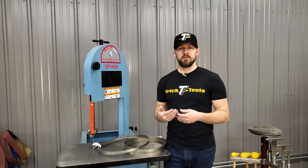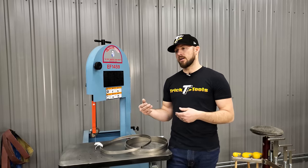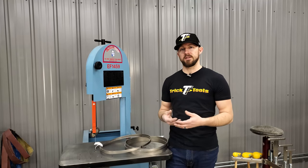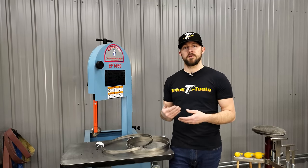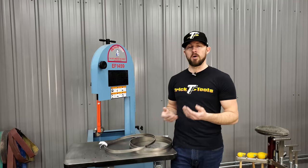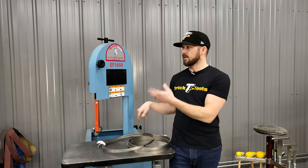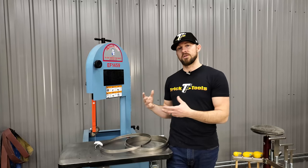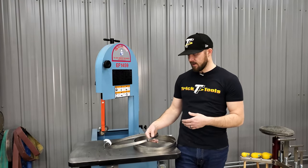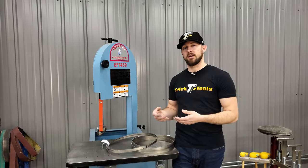That gives you the best cut. If you go to something thinner — say, tubing with a one-sixteenth inch wall thickness — you want a really fine blade. What's available may depend on what blade size your machine takes and what minimum tooth count is offered for that blade.